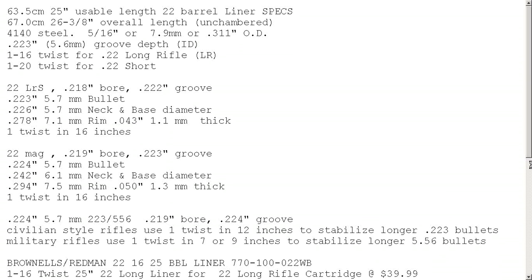In this screen you're seeing right now you'll see some basic information. I'm going to be using as an example the material to make a .22 caliber barrel with rifling, or making a pepperbox — which is a revolver where it's literally barrels with rifling and chambers and you fire bullets through it. That's pretty close to the design that was used. I'm using barrel liners because they are made to the industry standard and are used for repairing older .22 caliber rifles, with a type of twist rate — one rotation in 16 inches, 20 inches, 9 or 8 inches — that matches up with the performance requirement generically for long rifle, shorts, or .22 magnums.